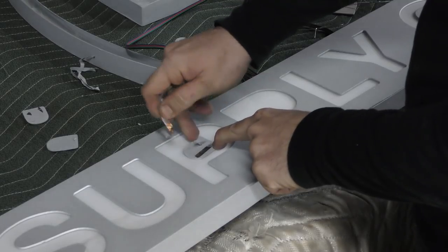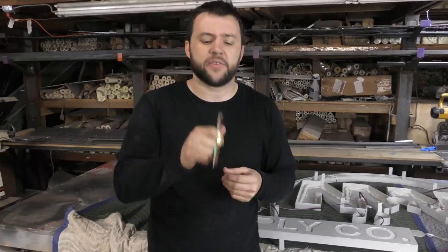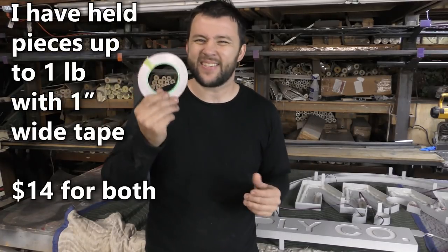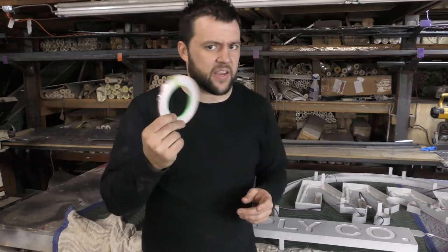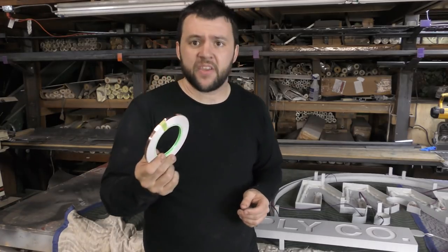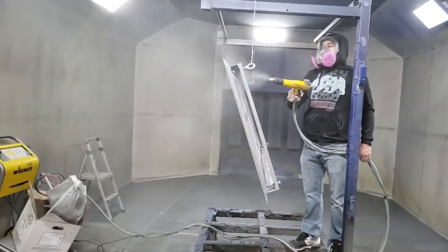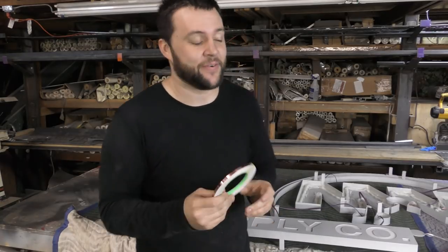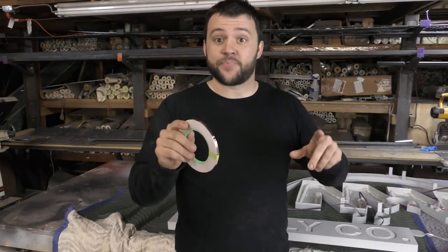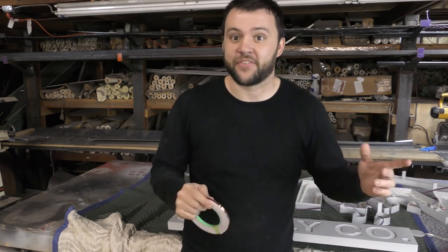I'll have a link in the description to this tape. It's like quarter-inch thick copper tape, comes in a bunch of different sizes — I think it's about six or seven dollars a roll, I bought a two pack. Good thing to have. You might have to convince your powder coater to try it, but mine was willing to and it worked — now he ordered himself a couple rolls so he can do little pieces that way. If you guys appreciate these shop tips, don't forget to subscribe. I'll see you on the next one. Thanks for stopping by.